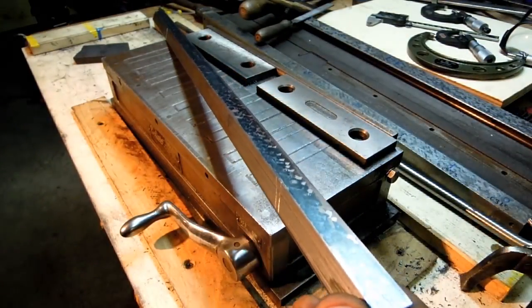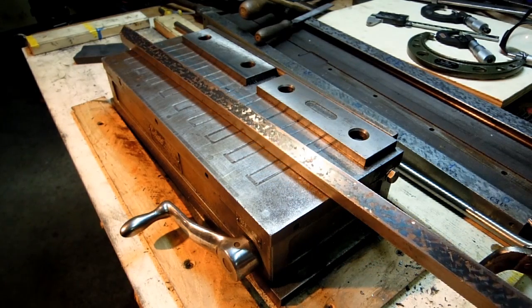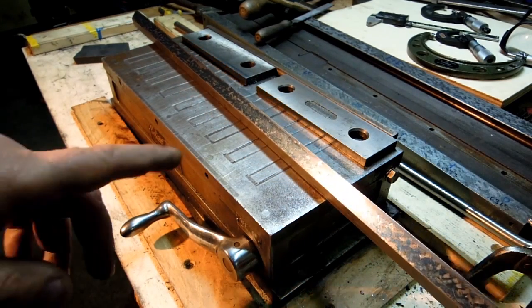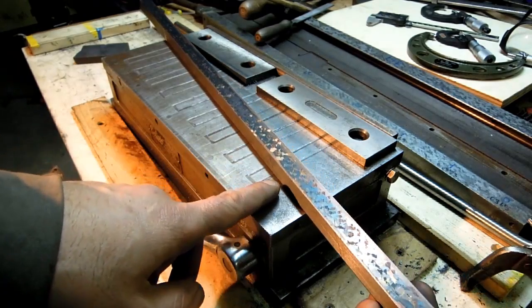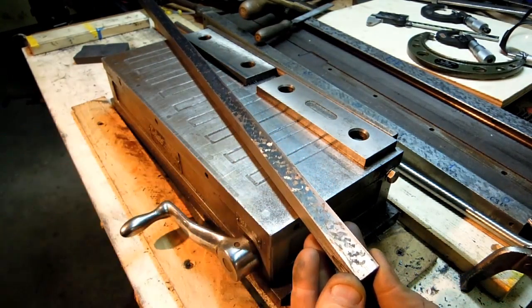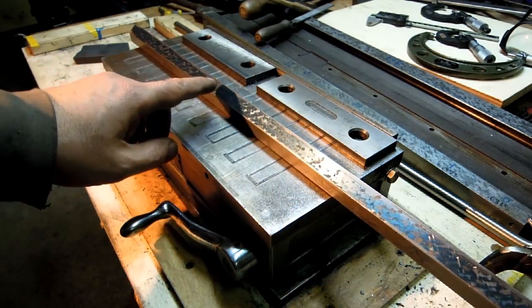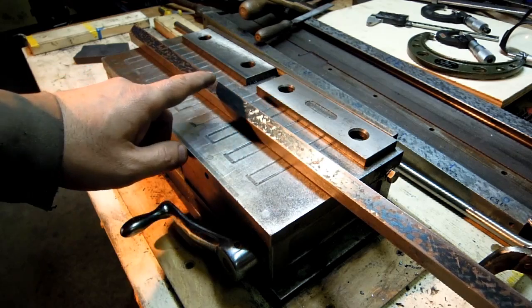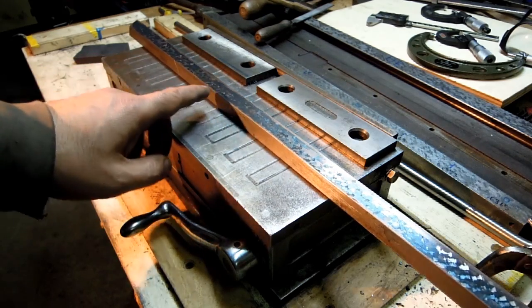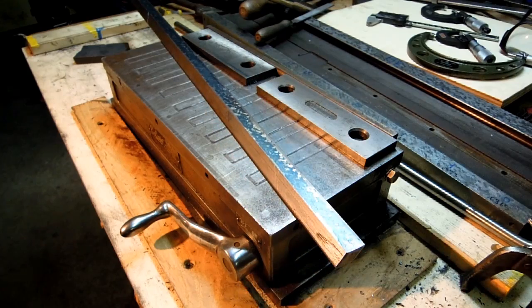Okay, so I don't know if you guys can make that out, but it's printing along the whole face. It's looking pretty decent. I just refreshed the plate, so the bluing's a little bit heavy, but the previous rounds were all telling me the same story. There's a couple of little low spots around the edge. That might have been my fault where I rolled a little bit with a file, but I think 1 or 2 more passes should get this in pretty good.